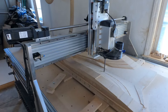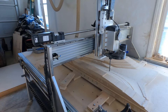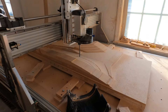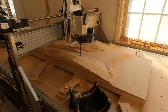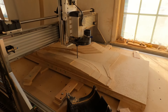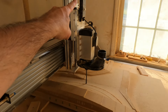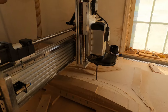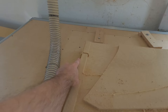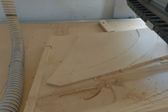I had to order new linear bearings, disassemble the machine, put them on, and recalibrate everything. I did that before I started cutting this mold. Once I started cutting I got to where I am now, but I've had a few more issues where the z-axis quits working and the head just drops — the end mill plunges into the part. It did it here, then again here after I restarted the machine, so I knew I had another issue.